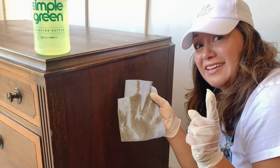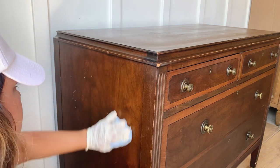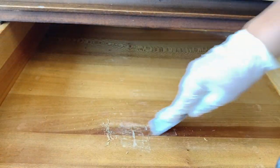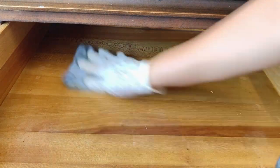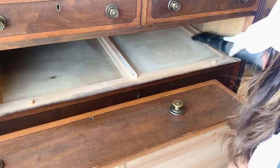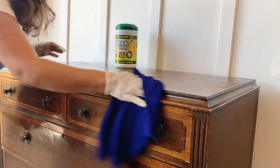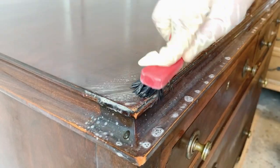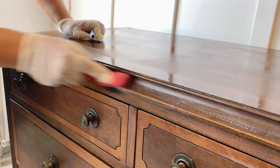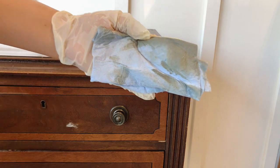This is why we clean before sanding — you don't want to push any of that grime into the wood grain. I see so many people out there painting furniture and the first thing they do is go straight to sanding. The abrasive in your sanding sheet opens the wood grain and at the same time pushes whatever is on the surface inside the grain. Unless those contaminants are removed first, when you apply paint, stain, or in today's case a color wash, it's almost like you're sealing dirty wood grain. All that grime comes up with your paint — it looks brown, pink, and makes your finish uneven. I'm trying to help you avoid frustration by teaching you this super important step of using a powerful degreaser before sanding.